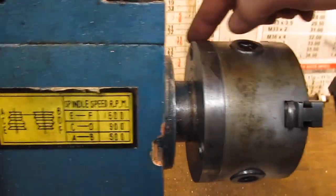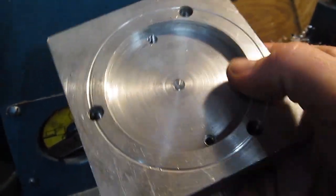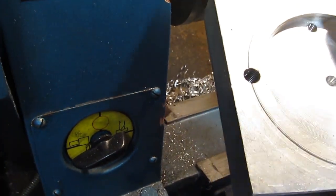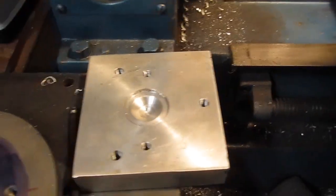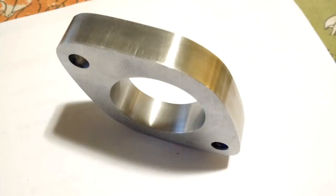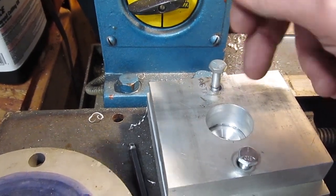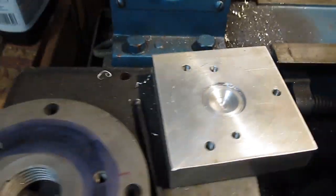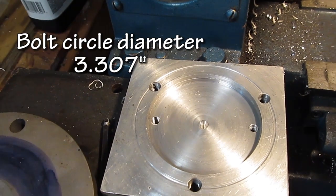The chuck is keyed onto this backing plate. This piece here is just a face plate that I made — it's got a register that it keys on. The third question was: can you make face plates? Yes, you can. This one was made to mount a solid piece of aluminum with bolt holes drilled at a set distance. It makes a little manifold for a Honda motorcycle, and this hole is actually tapered because the hole going into the engine and the carburetor are two different sizes. The bolt hole pattern is pretty standard — it's about three inches with three holes.